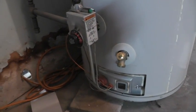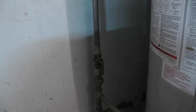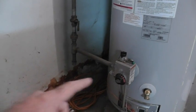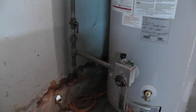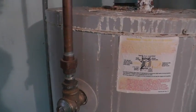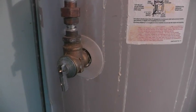The system uses gas from the street connected by iron pipe. You can see the wall in the basement here is kind of cardboard wall stuff that wicks up moisture from the concrete. Here's the shutoff valve. I noticed that this iron pipe is not supported in any way — this whole length, about 10 feet of iron pipe, and all of its weight is on that control valve. The pressure relief thing has been plumbed into some kind of fitting that goes up above the unit and runs across the ceiling about 10 feet, and you're not supposed to do that.